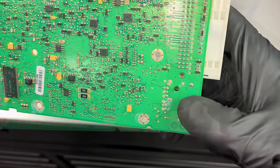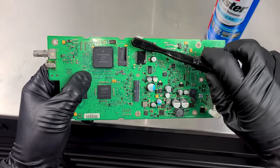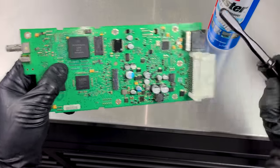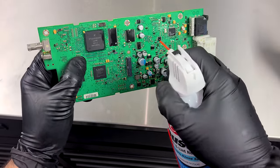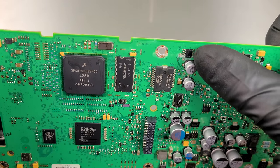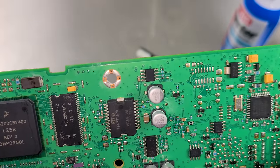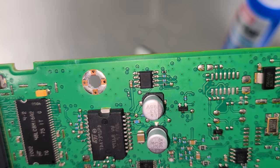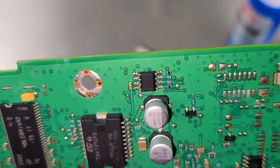And there you go - it's perfectly clean now. This is what it looked like before and here's what it looks like after: you give it a brush side to side, up and down just like your teeth, a little rinse and a little air. We went from heavy corrosion all the way to a perfectly clean circuit board. You don't see a break in any of those tiny circuits - it was just corrosion built up around them, which could definitely short circuits together, but if it hasn't physically blown through the trace, you're in good shape.